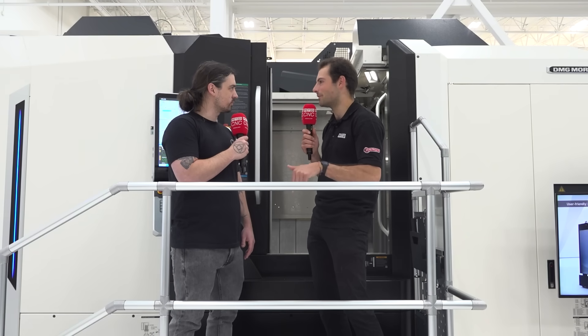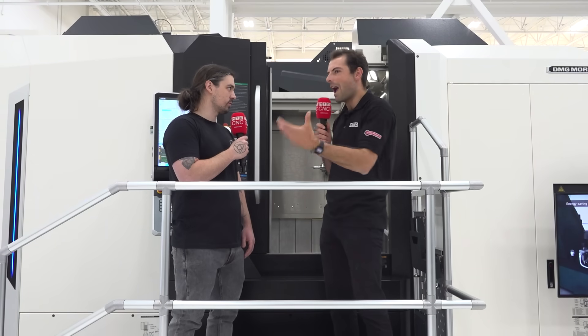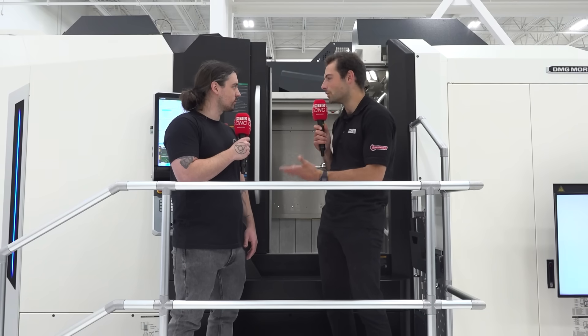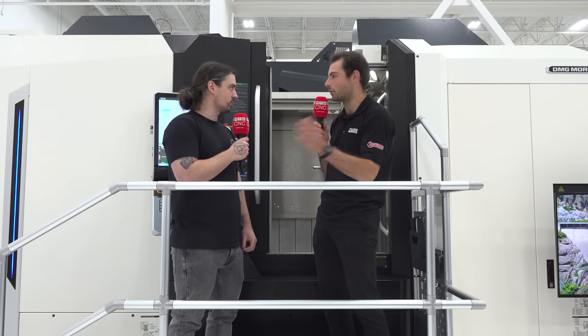There are really some brand new features people haven't seen before. Underlying these demonstrations is the concept DMG Mori USA calls machining transformation. To Nate, the first step is moving into multi-axis machining, utilizing five-axis equipment, and really reducing the amount of setups in your operations. Then from there, optimizing through automation and process integration to get the most done in the least amount of space and time.